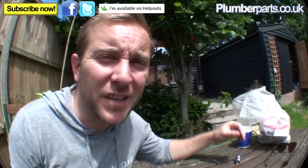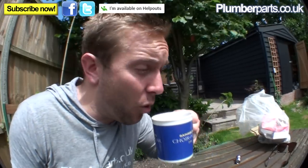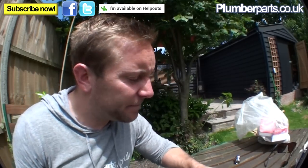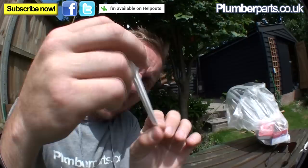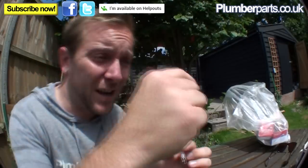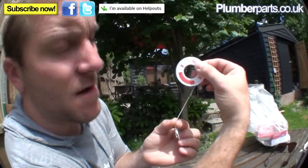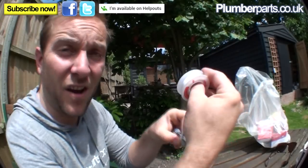So as with most things in life, it's basically how you set it up. But anyway, what most people get wrong is the way they set it up. So you want to pull off your PTFE so it's facing away from you. So the tag bit here is facing away from you. See that? You get your bit here and you pop your thumb on it, like so, right?